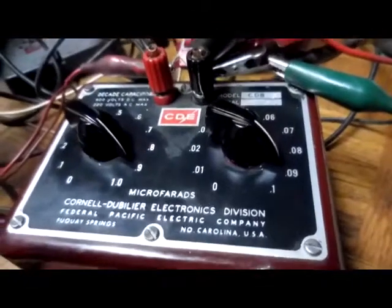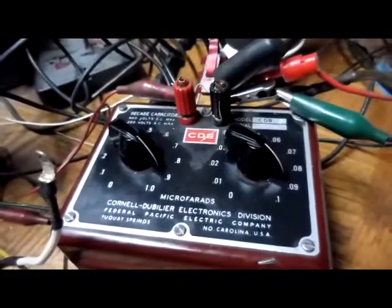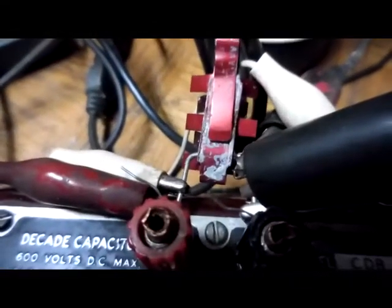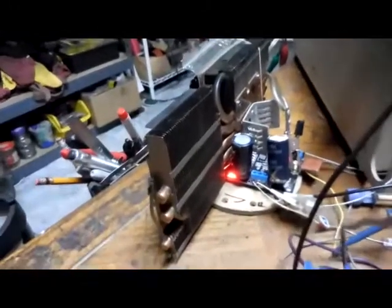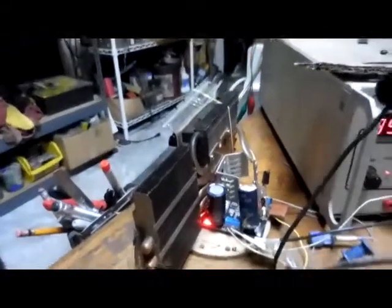If you set that low, you'll get a higher frequency, which doesn't seem to be as efficient as running it at a lower frequency with a higher capacitance. There's the one diode sitting across — I put a heat sink on it just in case. There's the fast-recovery FR diode sitting by itself. I really don't need these heat sinks on the OPA, but I put them on there. If you jack around with this thing, they will pull an amp or two, and if you're not careful it will get hot. It'll shut down by itself, but you really don't want that to happen.